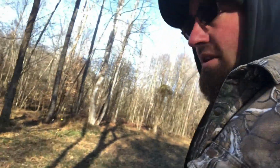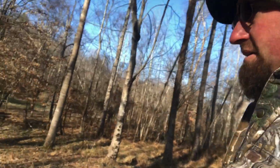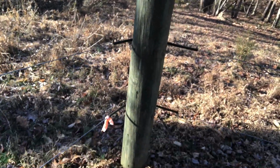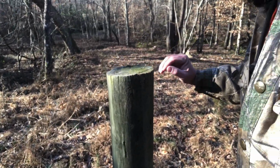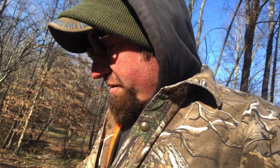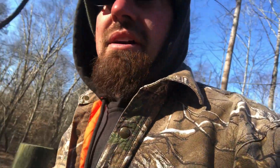So just like in my goat fence video, I'm just using one corner post right here. And it's a fairly big post. It's probably an 8-inch post. And it's 4 foot in the ground now. On this fencing here, with my goat fencing, it wasn't that much. But on this fencing where we do put pressure on it, we bury these things 4 foot. Well, I say it's 4 foot, and I'm guessing it's 4 foot.